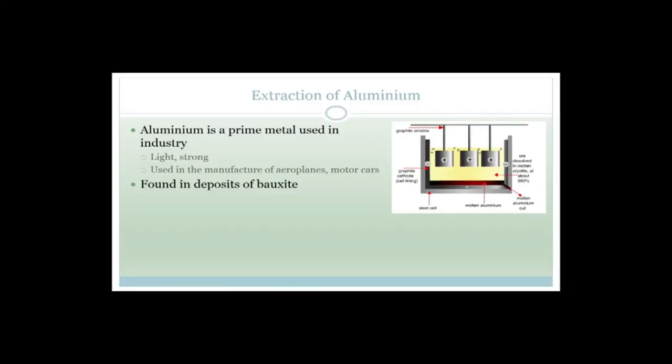It's kind of expensive, but it's better to import the bauxite than to import aluminium. The bauxite is a mixture of silica, iron oxide, and hydrated alumina. Please note that alumina is totally different from aluminium. Alumina is Al2O3·xH2O — it's aluminium oxide with a water of crystallisation attached to it. Alumina is a crystallised form that contains aluminium oxide with water of crystallisation in it.